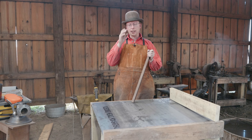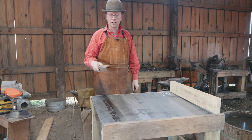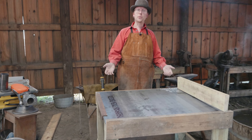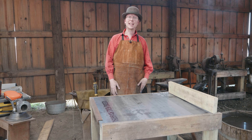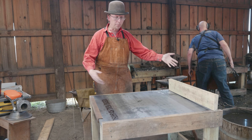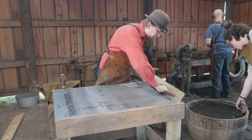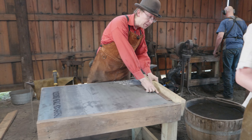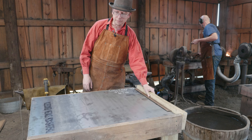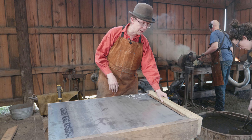What you're going to do is just cut your angle iron to size — the angle iron isn't screwed in, it just sits in here on each side. It provides a little extra support; it's not strictly necessary from a structural standpoint, but it will keep hot coals right off the wood, and that is something you want to do. The situation I'm in is I was a little too precise with my measurements and forgot that angle iron has thickness. I remember being in this exact situation when we built these in the past, so I'm popping off the sides and will screw them back in with the angle iron in place.